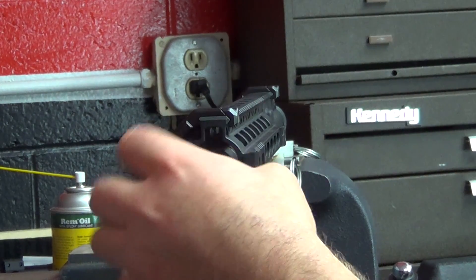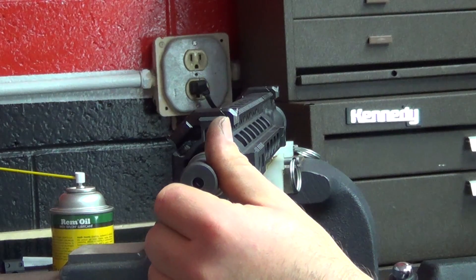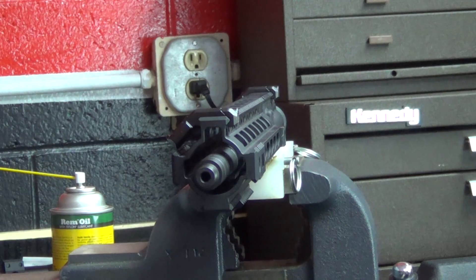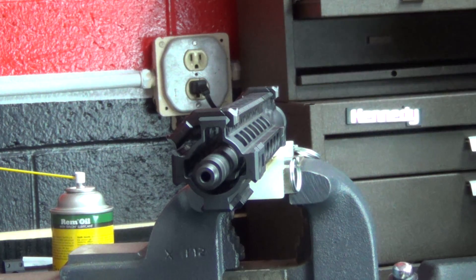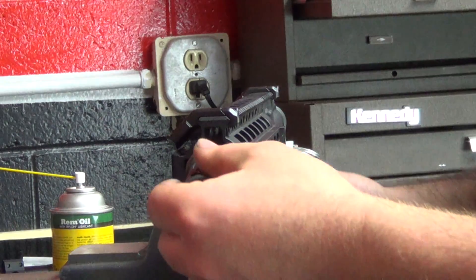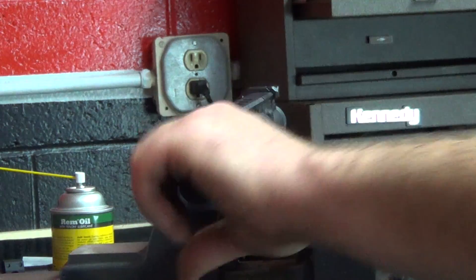This is another really important area when you're trying to accurize your AR-15 or AR-10 style rifle. If you over-torque your muzzle device, you can actually restrict the bore, and if you under-torque it, you're going to create a little bit of wiggle in the barrel-to-muzzle-device fitment. These shims are absolutely essential if you plan on running a suppressor, versus a crush washer, which would be acceptable if you're just planning on running the muzzle device. It's a little bit more time consuming, but it's worth it if you're going to be building your rifle properly.